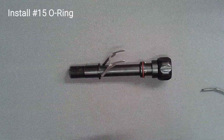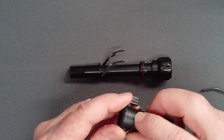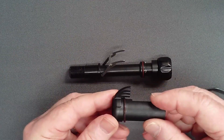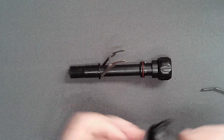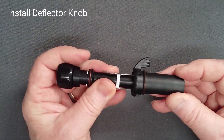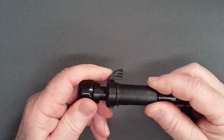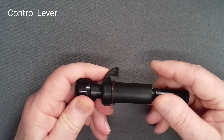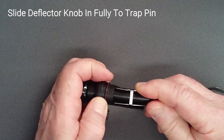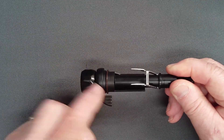Place a lightly lubricated O-ring on the deflector knob. Slide the deflector knob onto the adjust tube with the flange covering the lever — this will allow it to pass easily over the lever. Rotate the deflector 180 degrees while controlling the lever, and then slide it fully into place against the collar. The collar of the tube traps the pin in place.